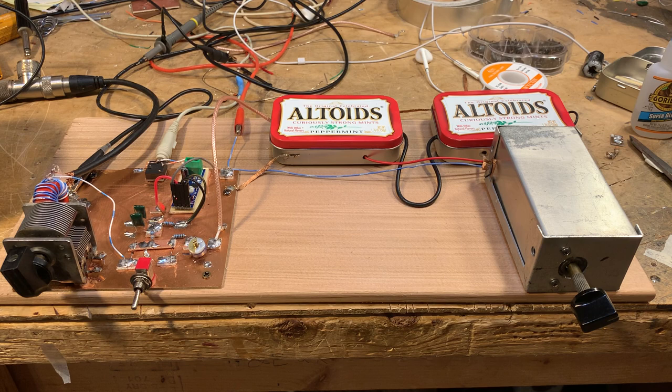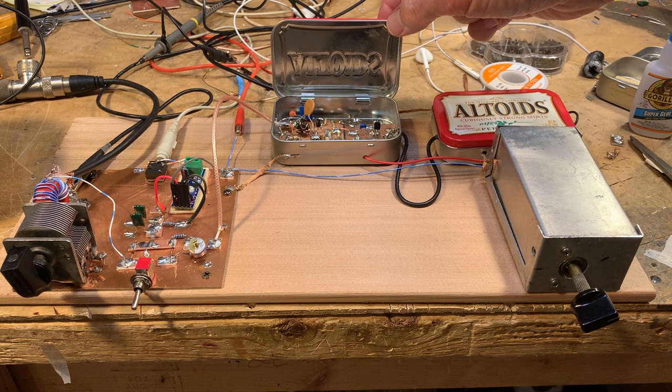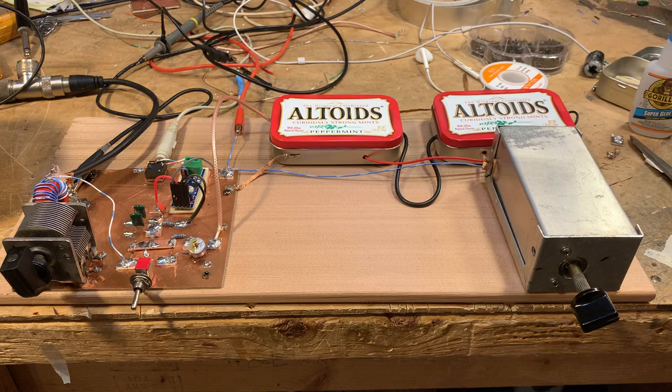This is a Polyakov direct conversion receiver, a circuit that was championed and developed for HF radio amateur use by Vladimir Polyakov, Radio Alpha 3 Alpha Alpha Echo. It's appeared over the years in a variety of different ham radio publications. Here's a quick tour: this box holds the coil and capacitors for the VFO, this box contains the VFO circuitry, this box contains an amplifier that boosts the VFO energy up to a level that can drive the heart of the whole thing, which is a Polyakov detector.